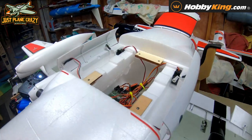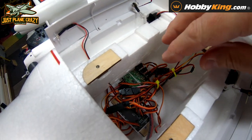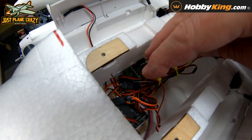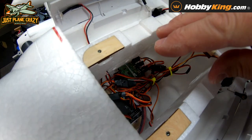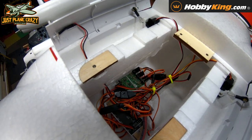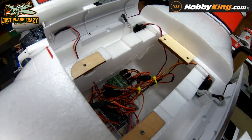To access the gear you'll need to put the gear out or open. Most of the wiring is held in with a big piece of reinforced tape. I chose to add some zip ties to clean things up and hold wires away from the gear, plus a little hot glue on all the tabs and the circuit board to make things more secure. They were focused on weight, so zip ties and a couple drops of hot glue add almost nothing.